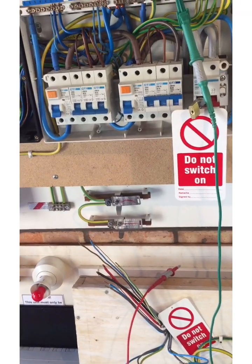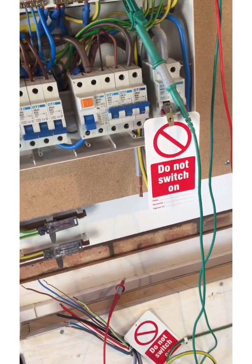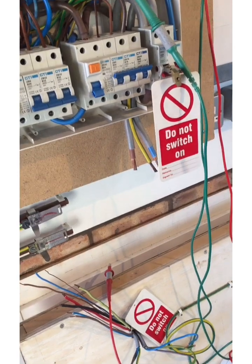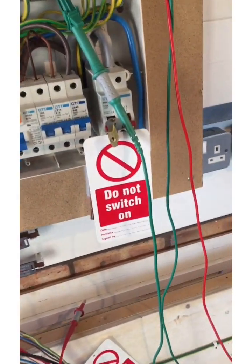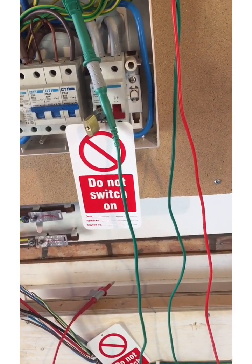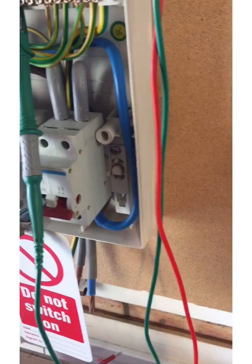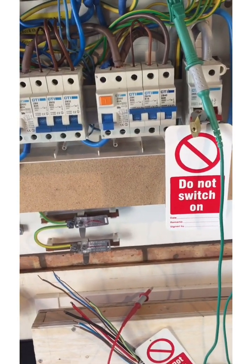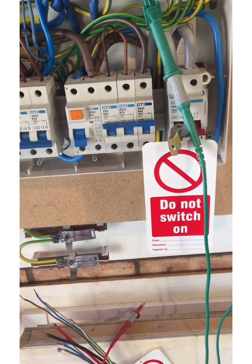Now, let's talk about the setup. The first thing to emphasise: it's a dead test. In this situation, if you could isolate the supply to the board, then you would. You can see here we've got open tails connected into the board. It's not often you're going to get a chance like that, where you've got a fully completed board with open tails that you can test to. Generally speaking, and let's be practical, you may be working on the board with the feed still in. So potentially up here this could be live, and we've got the load side of the board isolated. Either way, whatever's relevant — which you should be competent to decide if you're doing this kind of work — it's a dead test and we've got the relevant part isolated.